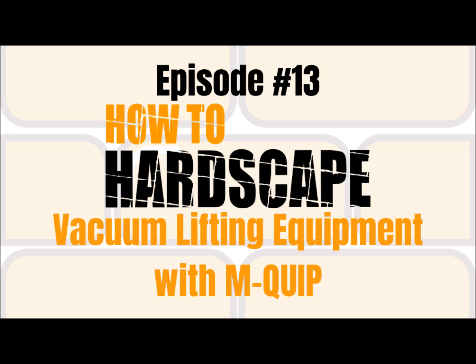Let's get into choosing the right lifting system for your needs. We need to get into talking about porous and non-porous materials in order to decide which lifting unit you're going to purchase. Can you explain porous and non-porous for somebody that doesn't understand? Porosity is one of the most important facets when it comes to vacuum lifting. Porosity is not the texture on the top — it is how dense the material is. Think of a dry cast paver as like a sponge with all these microscopic holes that you suck air through. Something completely airtight is something like steel or glass.